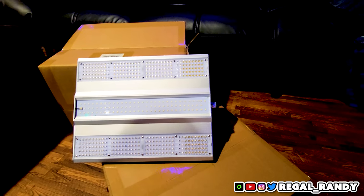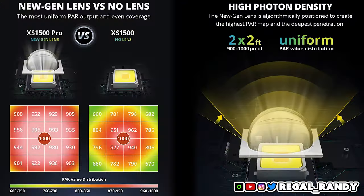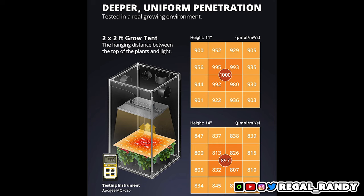If we flip it over we'll get a look at some of the first major differences, which are the three PCBs with the optical lenses. The XS1500 Pro version is definitely an upgrade from last year's model. The new optical lens uses a silicon sphere to focus the light better, and its PAR ratings clearly hit the corners deeper than without. At 11 inches you're getting the maximum PAR output, which is 942 micromoles, although I'd be careful putting them that close as some plants are sensitive to light and will burn.